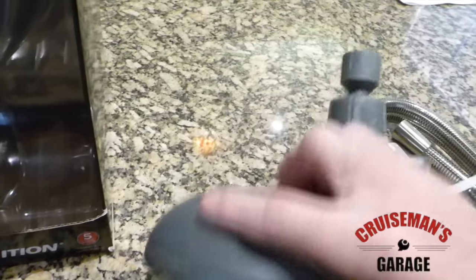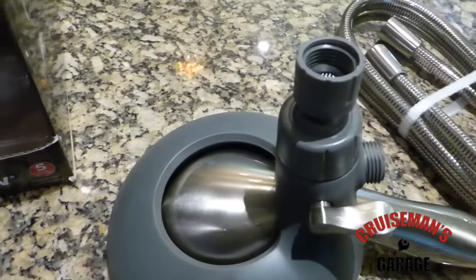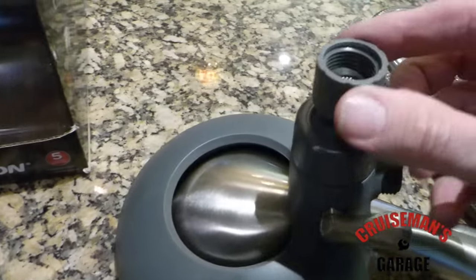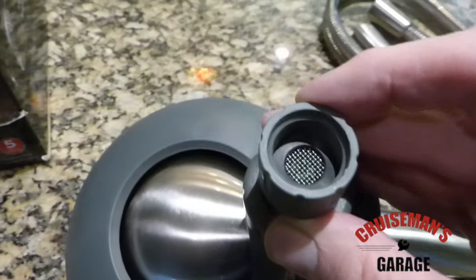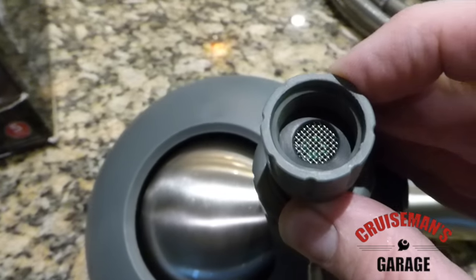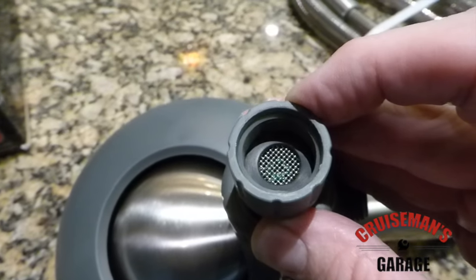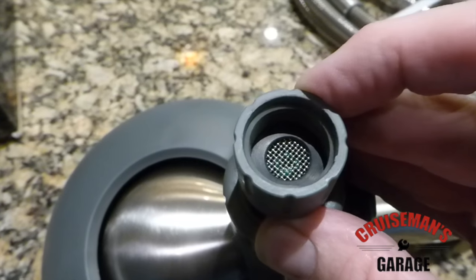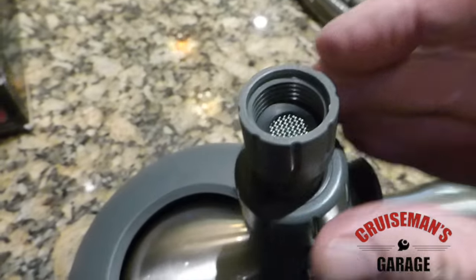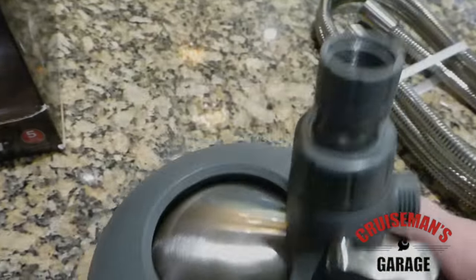This remains mounted to your water outlet on your shower. Inside here is a water restrictor underneath this screen. You're going to want to keep that screen — you don't want to damage it or that rubber seal. We'll take that out and then we should be able to get access to that water restrictor, which is going to allow the water to flow much more freely and give you much better water pressure when you're taking a shower.